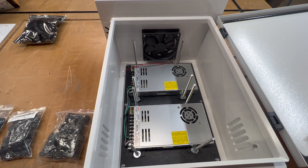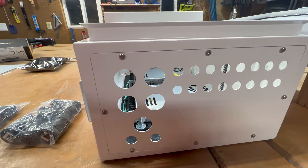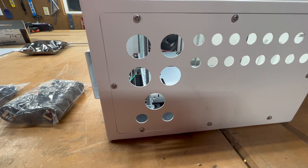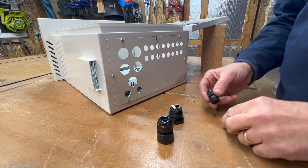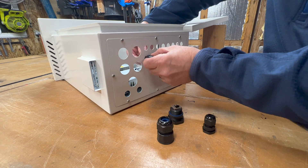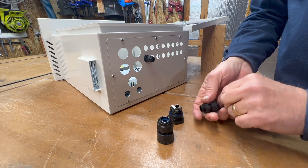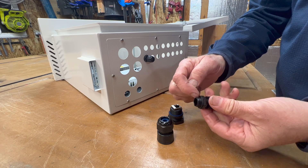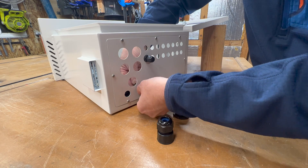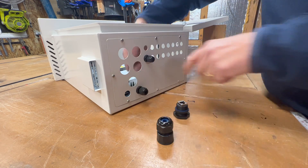Now that the power supplies are installed, I'm going to install the cable glands for the X-Connects or outputs for the controller, the ethernet connectors for receivers and your show network connection, as well as the power cords going into the box. Each connector has a nut on the back — you just unscrew it, put it in the hole, and tighten it up nice and snug. I do like the metal backer plate versus my bud boxes which are plastic. The plastic is thicker than the metal, so you get better thread engagement with these nuts on the back side. I've had issues with my bud box not having enough thread engagement to keep them secure.